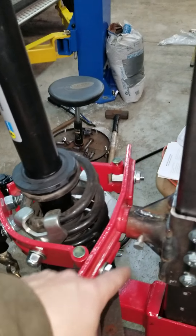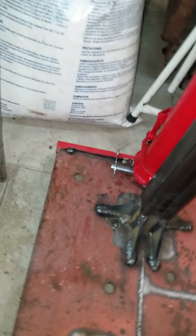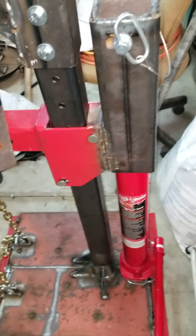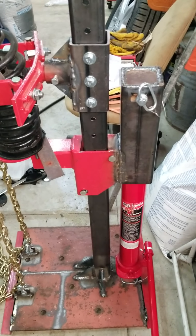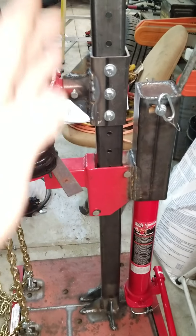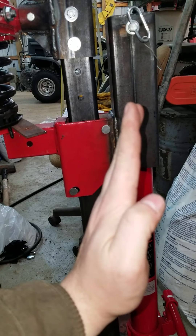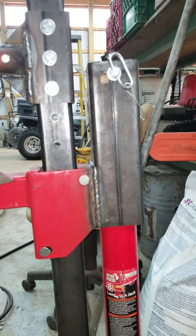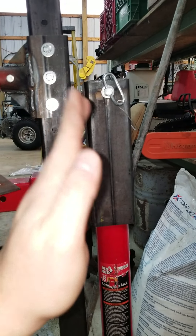I also welded another gusset onto the bottom. I put all new hardware all the way around — new nuts, extra washers for torsional protection, and extra gussets on the main column. Another big issue was the original jack had a flat base plate bolted to the base. No matter how thick the metal, this main column will bend slightly under pressure — and you need the jack to be able to move as well. With the unmodified version, the shaft would bend out of the end of the jack. So I used a jack with a clevis end that can move back and forth, and a clevis pin up top as well, so that rod has free travel to move instead of bend.